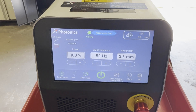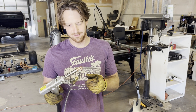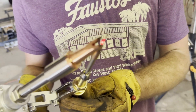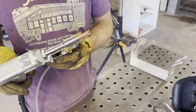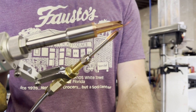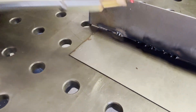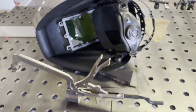These are the settings we ended up on when working with sheet steel. We increased the swing width, which increased the distance the laser travels back and forth, and then decreased the frequency down to 50 hertz. I found that when the wire is touching, it melts too early, so you've got to pull it off slightly so the point where the laser hits the wire is also the point where it hits the metal. Be careful not to press down because that pushes things. We have some bad welds, but also a nice section.